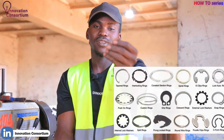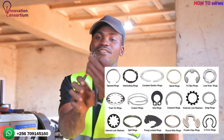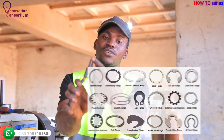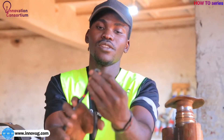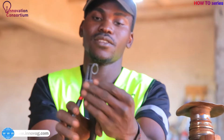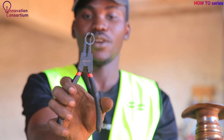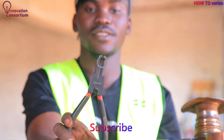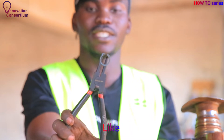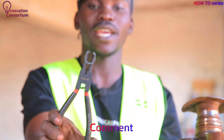This is what we call an external circlip. When I place the plier heads, you can see these two rods — they enter inside the holes of the circlip. All circlips have these holes. When I compress the two levers of the pliers, you can see it widening, because it is in a spring form — it widens.